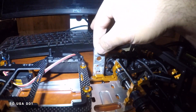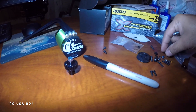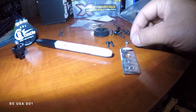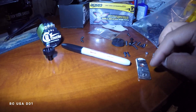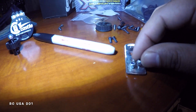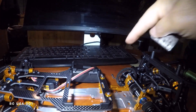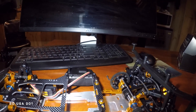I'm gonna take these long screws I have left over. One mistake I made — which is not really a mistake — is these two holes are too close. When I put this nut here the other one's gonna overlap. That's fine as long as it works. I'll put a few very thin washers so the nut can sit right there. The reason it's not a mistake is you don't have enough clearance there, so this guy needs to move back and forth so the motor can adjust to the pinion gear.